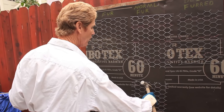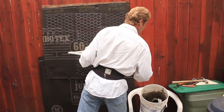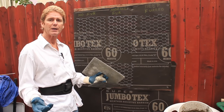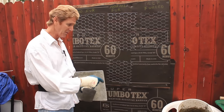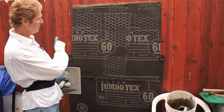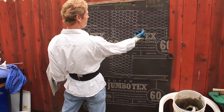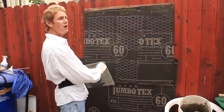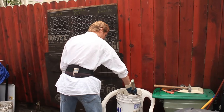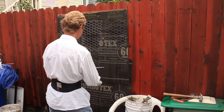I tell people that often when I look at their work and go, man, you stapled the piss out of it, didn't you? But you can do that too, guys. When you guys say Kirk, you put it on and it always sticks — that depends on the mixer. Jay mixed me up three kinds of mud: soupy mud, normal mud, and really stiff mud. Depending on what I have here is how I'll improvise. If the wire has self-furred nails in it, I'll improvise — I'll push harder, pull less. Right now I'm using a mud that's perfect for scratching.